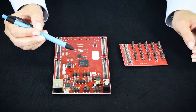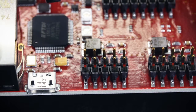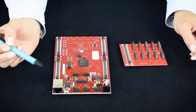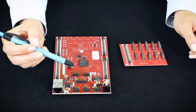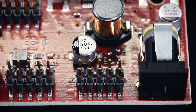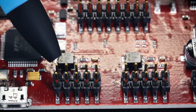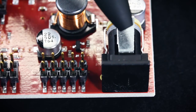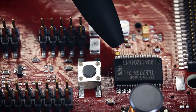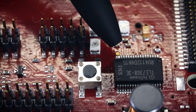Besides the microcontroller, there is a set of peripherals integrated in the board, such as a micro USB connected to the onboard miniWiggler for easy debugging, and headers to the Infineon LIN, FlexRay, and CAN transceiver. The board can be supplied by 5.5 to 50 DC volts, or via the Infineon power supply which steps down the voltage to 5 volts for the microcontroller.